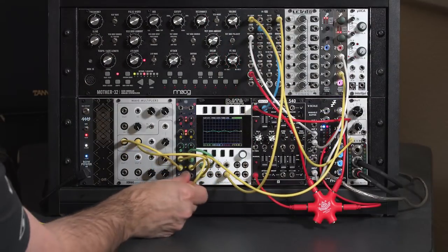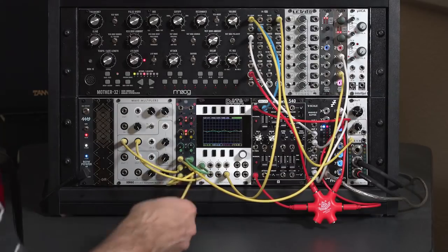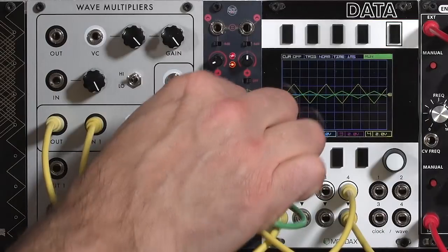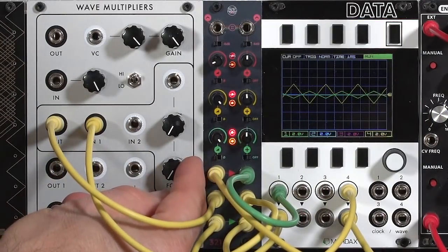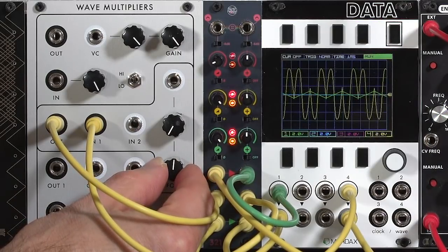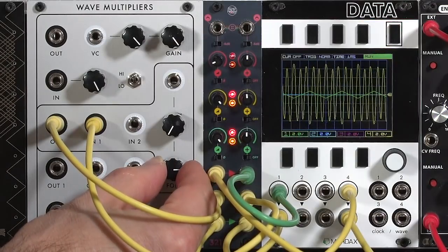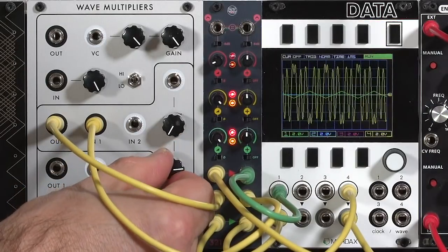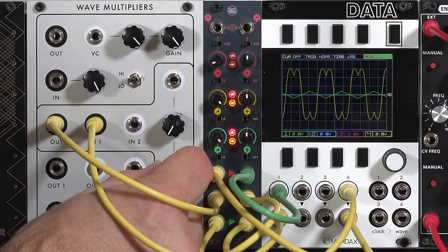Let me do a little cable routing — run through another channel of the 321, take the output, and boost that all the way up again. Now we're getting a more proper signal level. Now that we have the setup, we can go ahead and use the wave folder on the Surge to get the type of sounds we expect. So that would be the sweep we'd expect out of a Surge. I'll grab what was my filter envelope and use that to modulate the CV input on the Surge to put it through an envelope sweep.